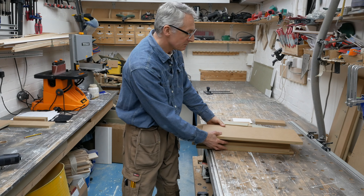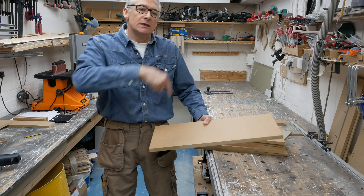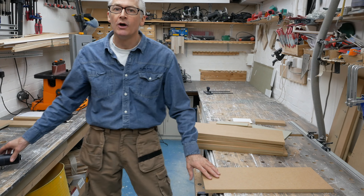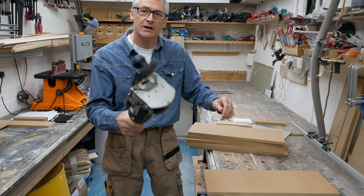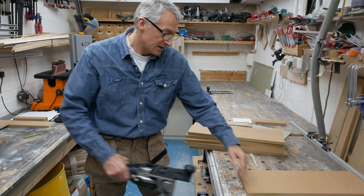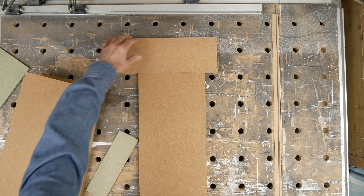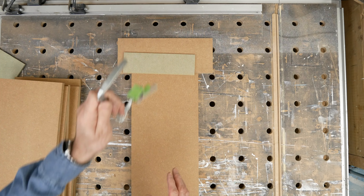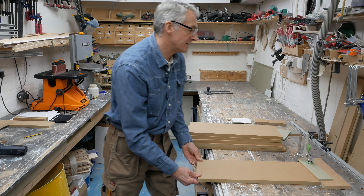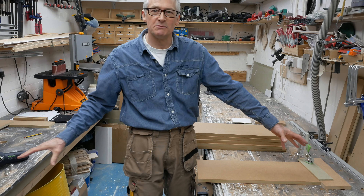You're busy, you're making stuff — I've got three of these to do, six sets of shelves, tops and bases, so 18 in total, 36 ends to do. I could put Dominoes in each of these but I'm not going to clamp and unclamp each one. What I really want to do is have the workpiece overhanging the edge of the bench so I can get my Dominoes in. Except they're too small — they go to the end of the fence and I can't get the Domino in there. So I scrubble around, find a bit of scrap that's the same thickness, add another little piece on top, get a clamp on there — and then you're good to go. Except you never have these bits and pieces to hand.